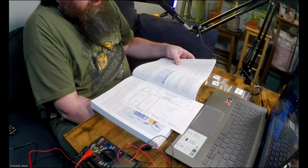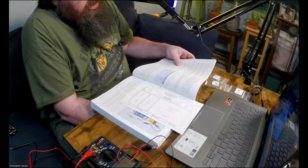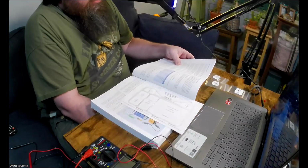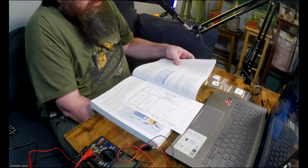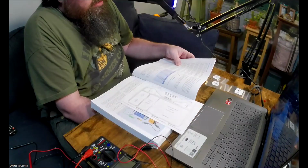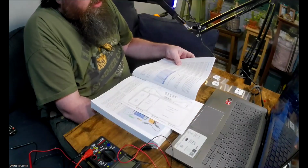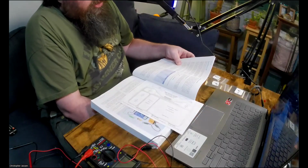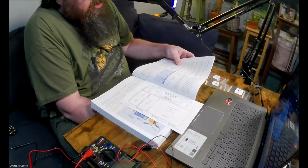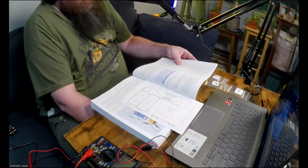Electric current is the flow of electricity per second, usually measured in amperes, which are abbreviated as amps. The flow consists of electrons, each of which is a tiny particle carrying an electric charge. If your human senses were fast enough to count electrons as they zip through a wire, you can measure 1 amp as 6.25 quintillion electrons per second in American quintillions. Ha ha ha.